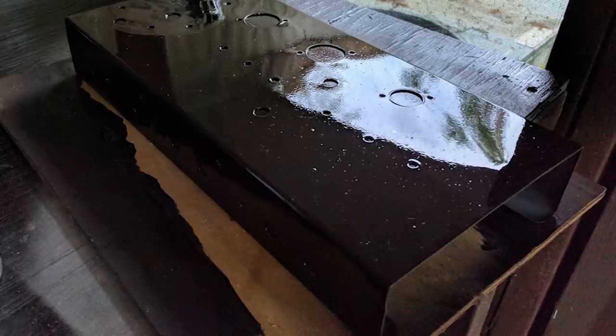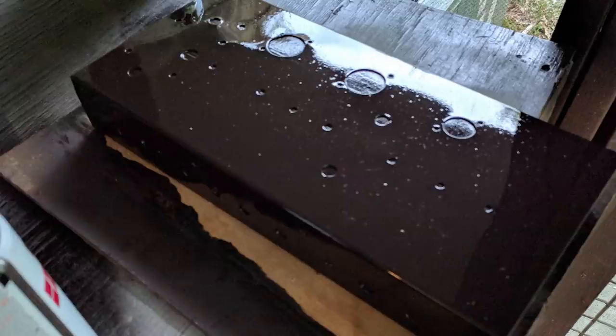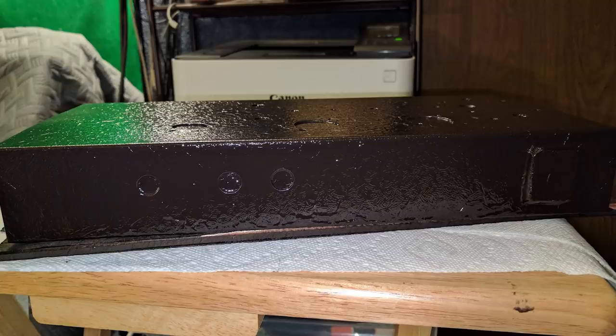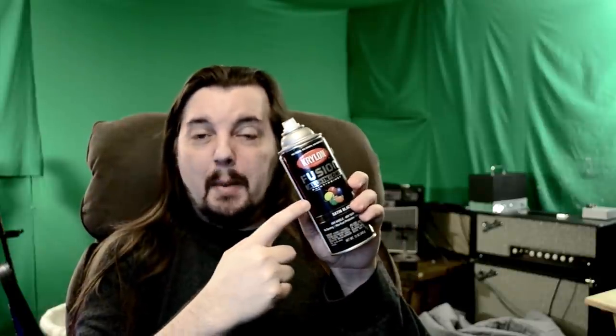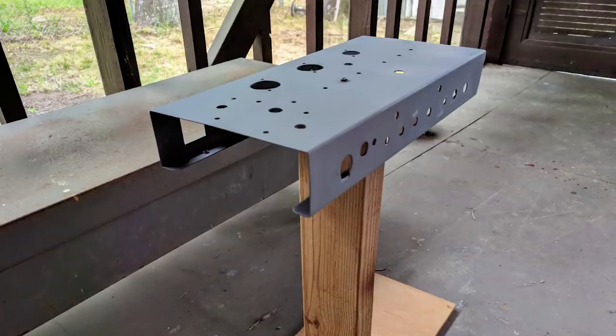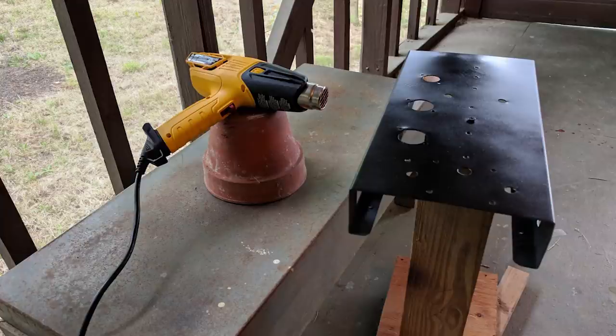Next, I stripped the chassis and drilled holes for the tube socket. Now, this chassis is made of steel, so in time it could rust. That's why I put on a coat of spray enamel — and what? For the life of me, I don't know what in the hell happened there. All I know is that this 'paint plus primer all in one' — these are lies. While the finish accidentally looked really neat, by the next day it had self-destructed. So, start over. Acetone and sanding to strip it bare, and this time we use a proper primer and finish it up with several coats. There we go.